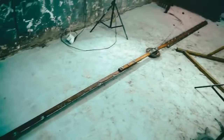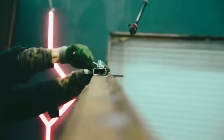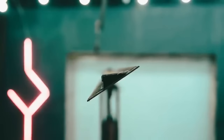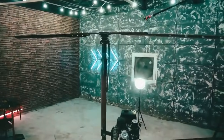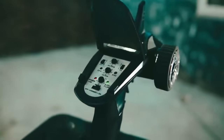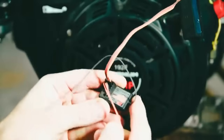The air screw turned out to be about five meters. We fix it on the bushing with bolts. Since it won't be possible to control the paddle inclination, we set them on takeoff as much as possible. We didn't know if it was possible and made it according to a drawing we found in the dump. We even wonder whether it is possible to keep altitude with such an air screw design. We test the entire construction remotely as we are not sure about its reliability at all.